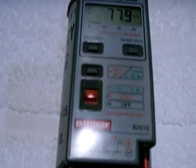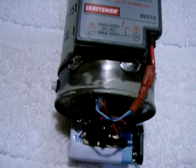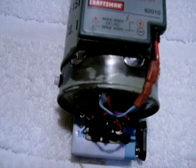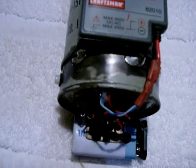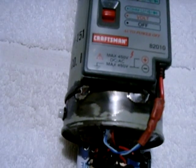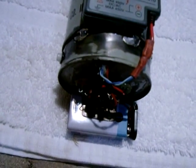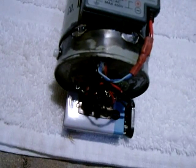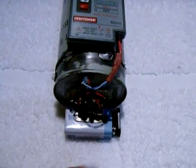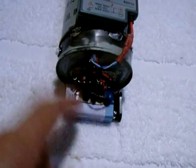Once you complete the circuit, if you're having a problem detecting something, on pin 1 and pin 7 of the LM358 there's a 1-megohm going into a 10k. Try raising the 1 meg to maybe 1.2 or 1.5 megohms and checking again to see if you're detecting. If not, try lowering the 10k that's in series with the 1 meg. In my case this meter is set up for 1.2 megohms in series with 6800 ohms, and that gave me the sensitivity I needed.